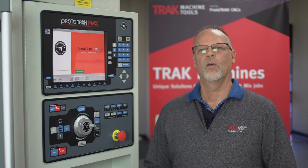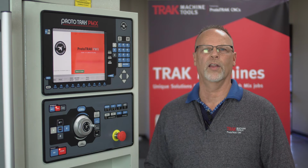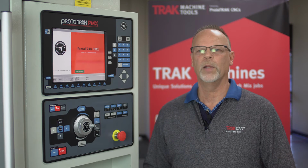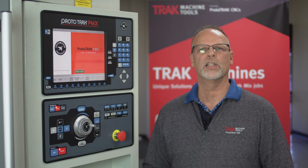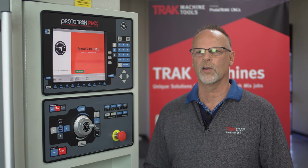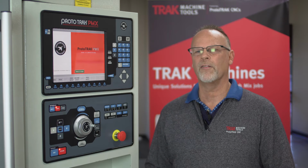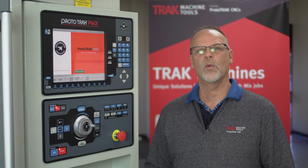And therefore, what most of your time is spent is setting up one job, taking down another, getting everything ready to go. Between the ball lock system that's built into this machine and the way that we have a checklist and some other things that make it fast and easy to go from one to the other, we've been able to knock down the setup time, or the changeover time as a lot of people like to call it, to about 15 minutes or less. And that's what we're going to show you today.